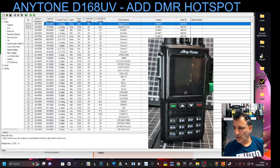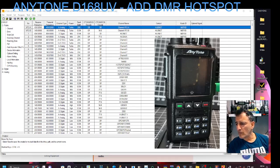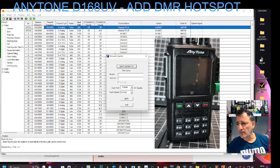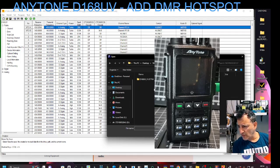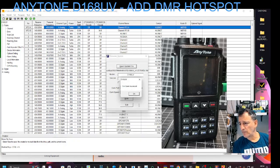At the top of the CPS, go to Tool, then Firmware Update. Then select the file: click Open File, go to your desktop, find the '168' folder, and you want the SPI file — select that. Double-click the SPI file. The radio screen will go black. It says the file has been successfully loaded — click OK.